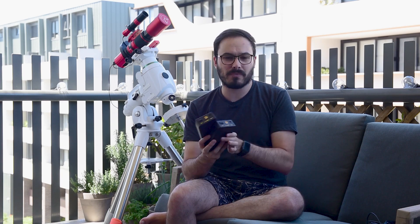So the multi-battery setup is very similar to the first setup that we have. The only difference is that you need a battery for each of the accessories that you are looking to power. So in this case I'm going to be powering a mount with one battery and a camera with a second battery. I've actually got three of these TalentCell batteries because I like them so much, and I usually use the third one for either a dew heater or a flat panel.